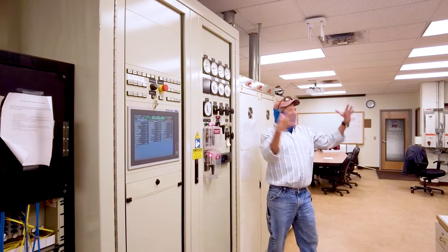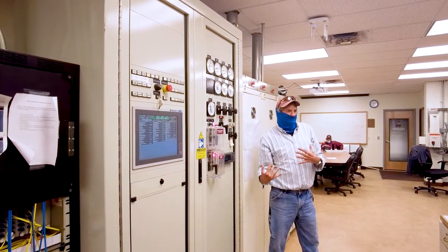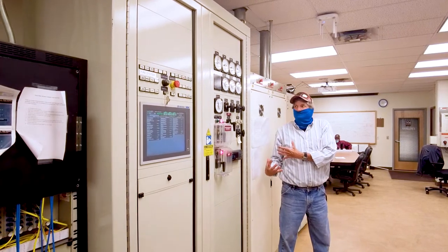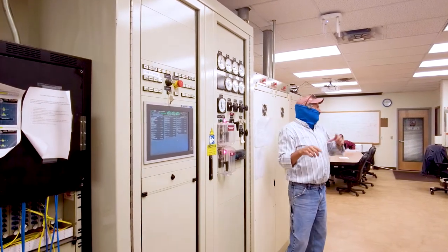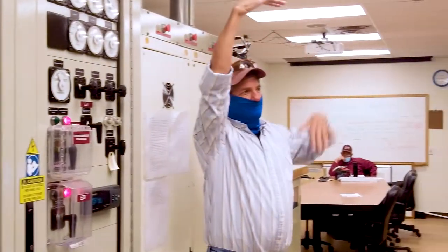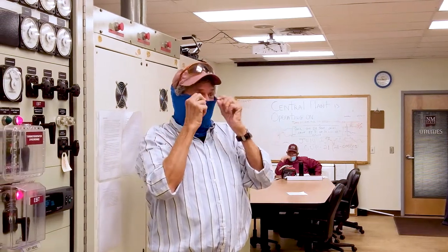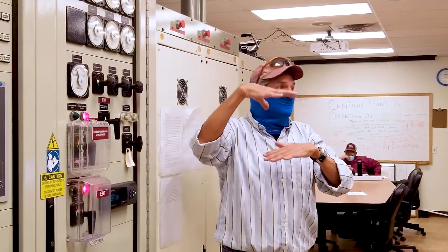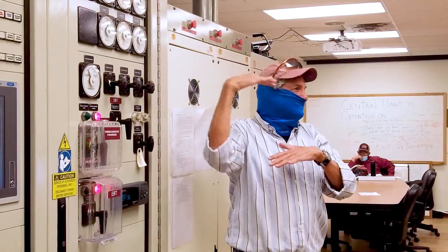So what happens when you put polar air into your engine? You get more air into the engine, you get more horsepower coming out, right? Same thing with this. We have radiators, like evaporative cooling, that we send air through in the summer to cool the air down. You know, it's 100 degrees out. We can get it down to about 50, 60 degrees when it's really hot outside. And so that keeps our turbine putting out a nice, even amount of power.